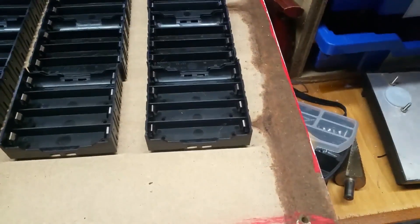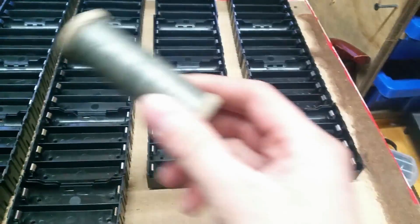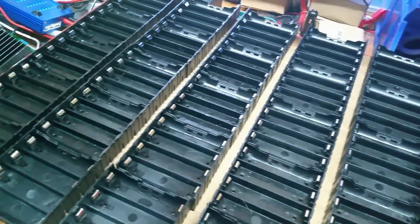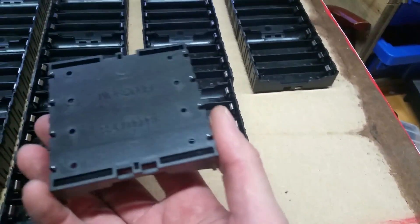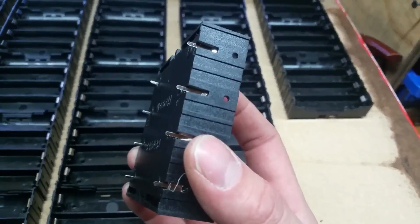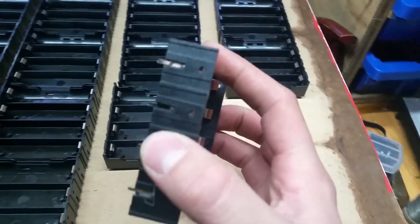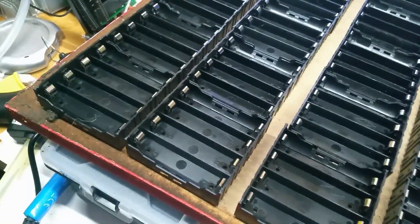Too late — I've already bought half the stuff. Solder won't be a problem for the majority of this project. Fuse wire, on the other hand — I've got a big spool of five-amp fuse wire. For this project I'm thinking it doesn't have to have a fuse per cell; we might just put a five-amp fuse per four cells. It won't make a huge difference for these duff cells. All the ones with pins means lots of soldering, which I'm happy to do because my soldering is naff and I need to improve.